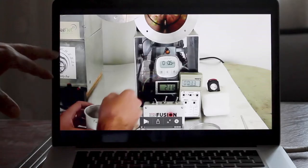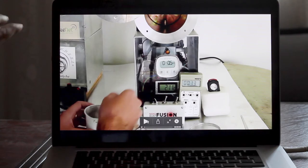we used our own electromagnetic cavity resonator, which was already more efficient than a household microwave oven. The household microwave oven was designed, let's say, to warm up soup or a chicken, but not to maintain plasma. So step by step, we have improved our device where the electromagnetic energy is more focused into the plasma. This is very important.